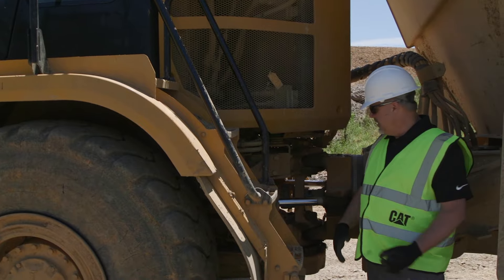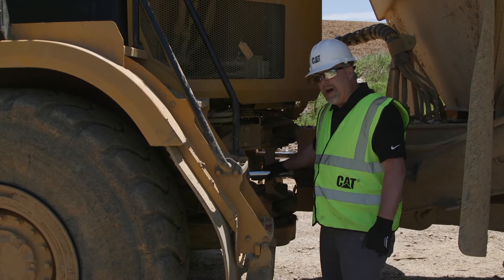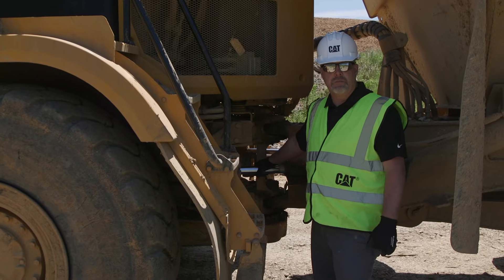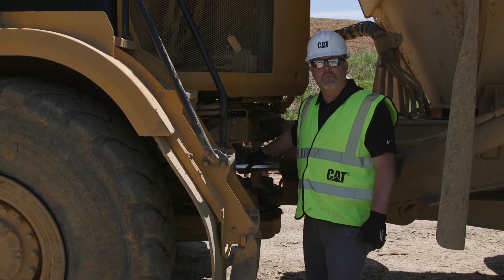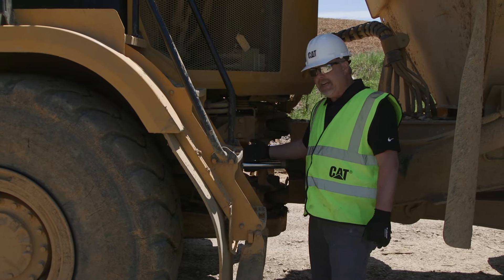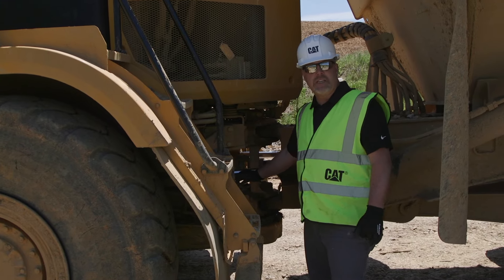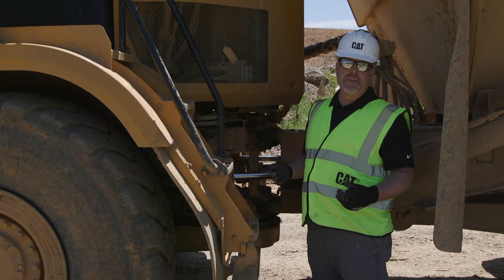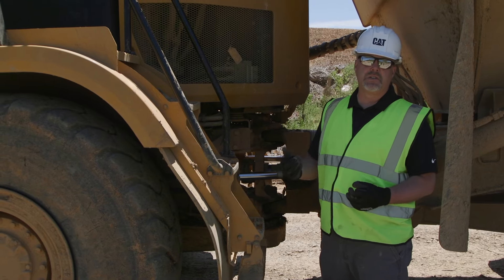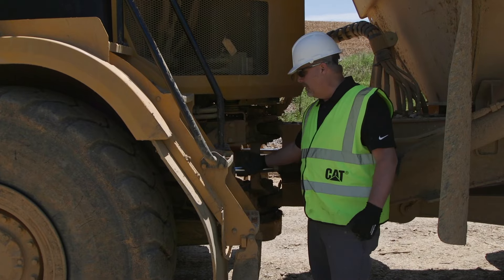I'm also going to look inside and make sure I don't have any leaks or broken lines. We've talked about our steering cylinders before — on any of our machines with the chrome, always want to check out that chrome on my hydraulic cylinders. Always a good idea to keep a rag with me so I can wipe off that dust around the seal on the end of that hydraulic cylinder, because as that builds up with dust and every time that cylinder goes in and out it takes a little bit of debris with it, and before long I'll end up with a leak around that seal.